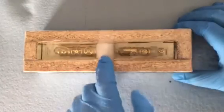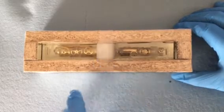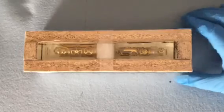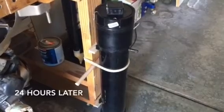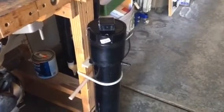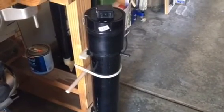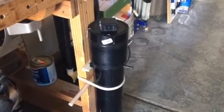That's just been poured, and you can see how the tape's holding that down. You can see the air bubbles already floating to the surface, but I'm going to put that inside the pressure tank. Here's my pressure tank — I've got the piece inside with the cap on it. I've got a tourniquet wrapped around it, because it's hard to hold on to and turn. I need that secured so I can break the cap loose.